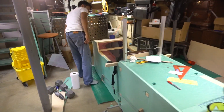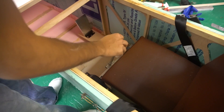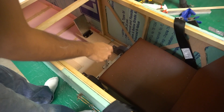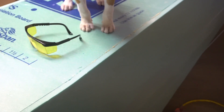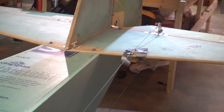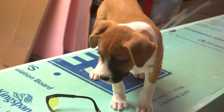I also worked on the cockpit. It's made out of plywood and foam. I have the control stick setup in here — I have this aluminum bar, and I'm going to drill a hole and run the cable through these fairleads. They come out through the back, and that gives my aileron control, so it uncouples the pitch from the roll. Pitch is simply out here, which is really easy to inspect before every flight. I have horrible nightmares about the elevator failing — that's pretty much the critical class-one failure. If you lose the elevator, you are pretty much screwed.